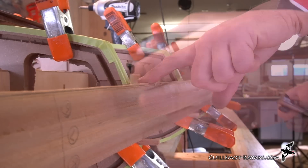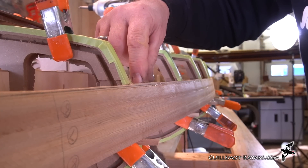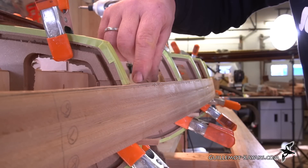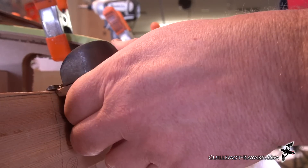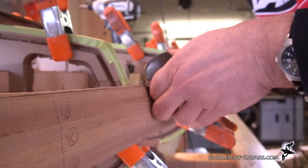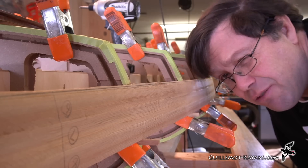When you've identified a high spot, start in the middle of it and shave down the middle of it. Then take slightly longer strokes as you go. When you cut off the high spot, you end up making a little flat spot on top that's a little bit wider. Each time you cut down, you make the top of that high spot a little bit wider. So increase the length of your strokes with each pass. Get your eyeball down on it and look at what's going on — we're not just the power source for this tool. It's putting it where you need it and cutting off what needs to be removed.